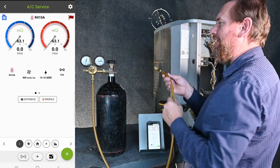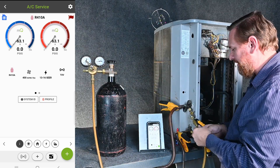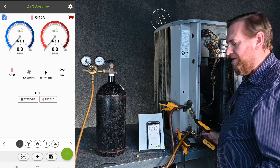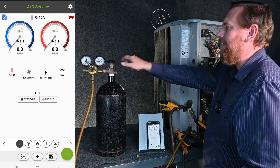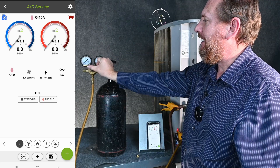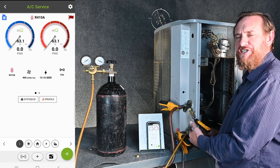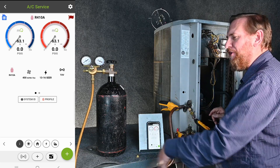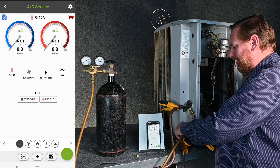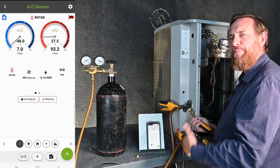I'm gonna add nitrogen to the system. I have my nitrogen tank set up, backed out on this point here, and I just have my nitrogen hose. I'm gonna connect it to my high side T and leave this valve off. I'll open my tank up, allow pressure to my tank pressure gauge. Now ideally we're gonna do a sweep — I can leave this loose at the T on my suction side. When I open my little ball valve, nitrogen's flowing in and leaking out here, so I know I'm purging any air out.